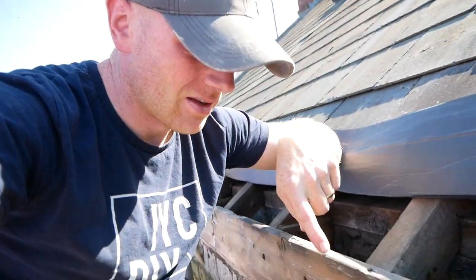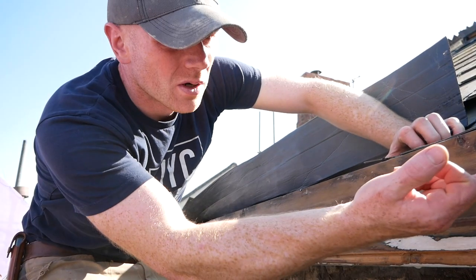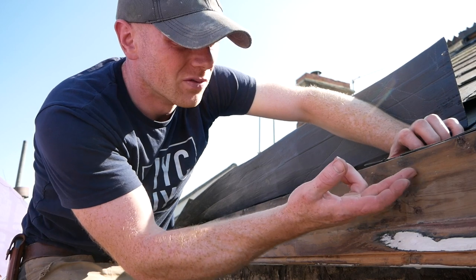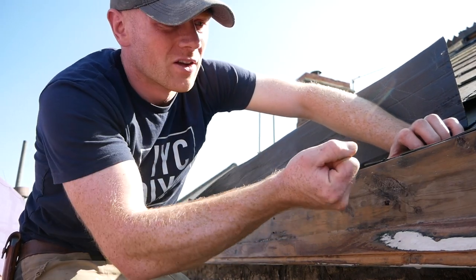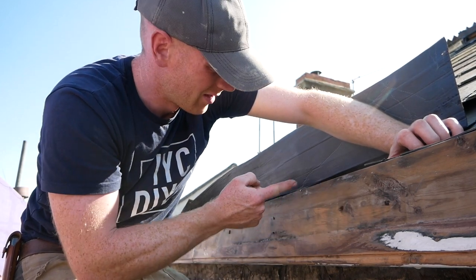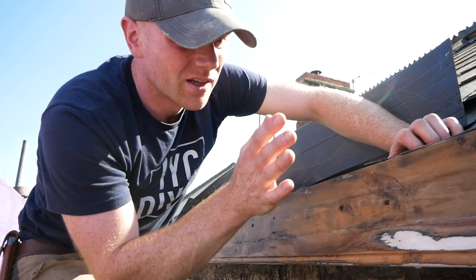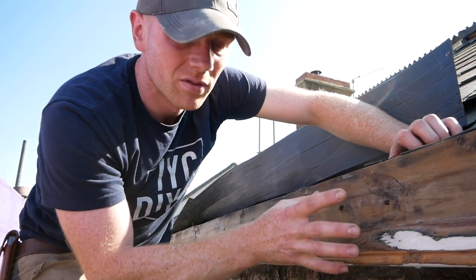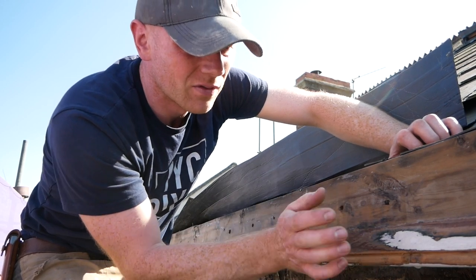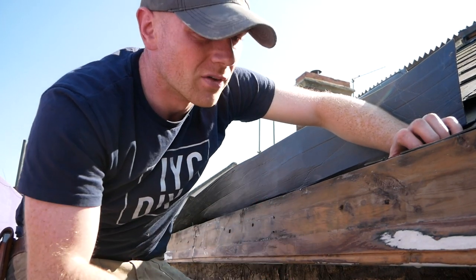For that reason, this fascia needs to be considerably lower. Now, of course, I could try ripping the 40 millimeters or whatever that I need to remove off here with a circular saw or even a track saw, and it's doable, but there's screws, there's nails, and it could all get a bit messy. Therefore, I'm going to take this off now and replace it. I've ordered some really high quality premium redwood for the sides, for the fascia and the soffit, and a really high grade paint system, and it should be perfect for what we need.